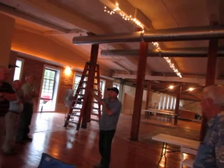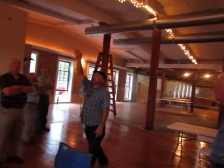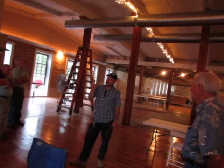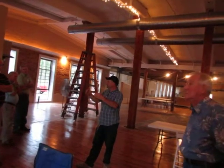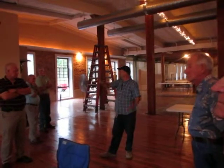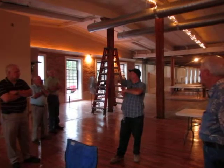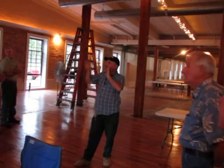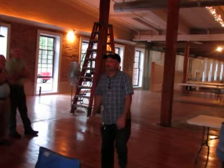Just like the window frames, when you look at them, I told you we tore that building down across the road. Well, it had beams very similar to this in it, not quite as big. We took all those to the sawmill because these window frames are 2.5 inches thick by 13 inches wide. You can't buy that type of lumber anywhere. Each frame weighs 300 pounds. So we set each frame back in the hole, shot Great Stuff foam all the way around them, and reproduced all the moldings based off of one window I had. So that was no fun.